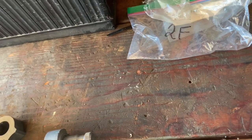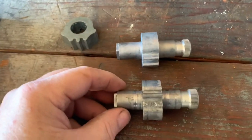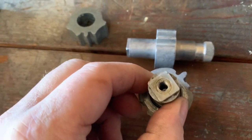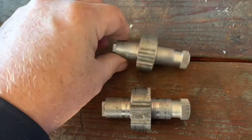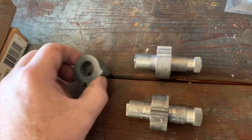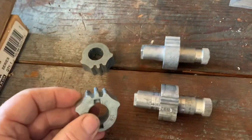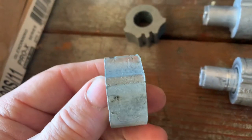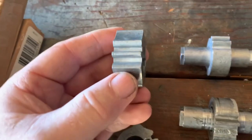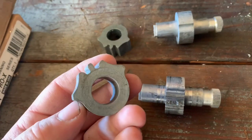The original gear I pulled out of the unit is here — you can see it's missing a tooth. That has been creating some real problems inside that control box: too much force to shift the gears and to throttle up and down on the motor, causing real stress and breakage. The teeth are pretty well nicked up here too, so it was just a matter of time before this one was going to fail anyway. I decided to just order all new and put these in — this should really improve the shifting and throttling.